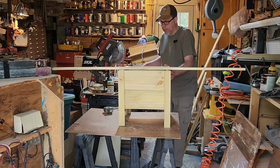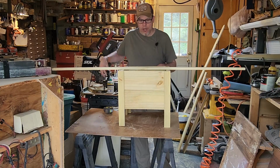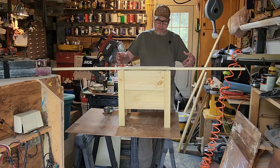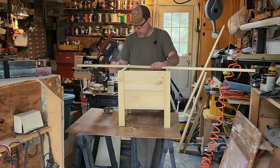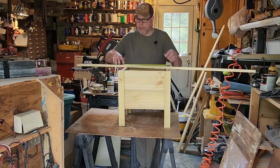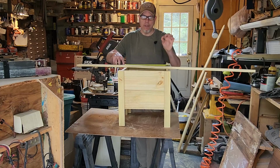Yeah, I have the measurements here in a cut sheet, but the way the pickets come, they don't always end up the exact size that you're cutting. They could be warped, they could be turned a little bit, they could be the right size, but they may be bowed or whatever. So on the last one I did, I cut the 45s, I think at 15. So that's going to leave a little bit of lip all the way around. And I'm trying to make it match the other one. So I'm going to try to leave that little lip like the last one.